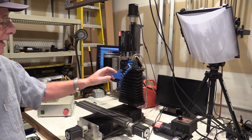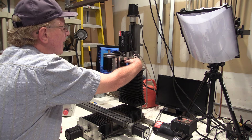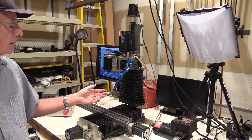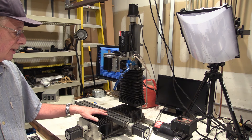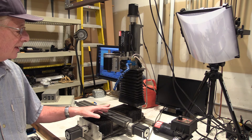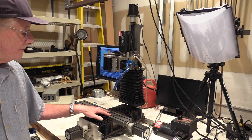I also have a cool mist attachment on the machine — it's attached magnetically, and I have magnetic pads on both sides of the machine for things like that. Cool mist comes with a chemical that, when mixed with air, gets incredibly cold, keeping your tool cold while blowing a stream of air. In instances where you don't need the mist — because this is mist, not flood — you can adjust the nozzle and just let air go out, which is what I do when milling something like brass, because you always want to clear the chips when cutting.